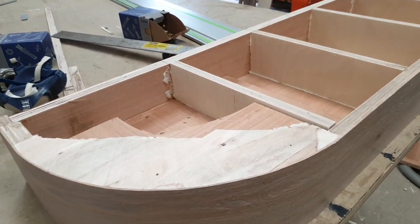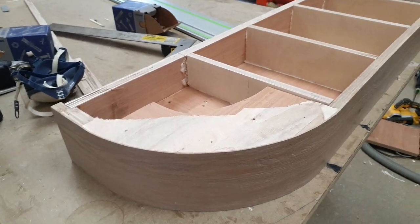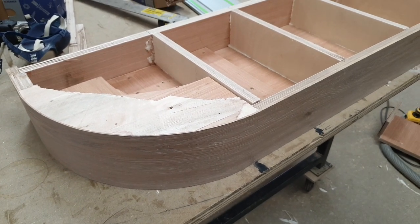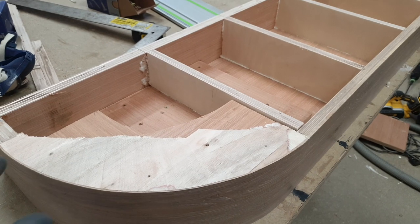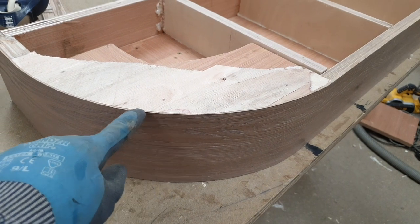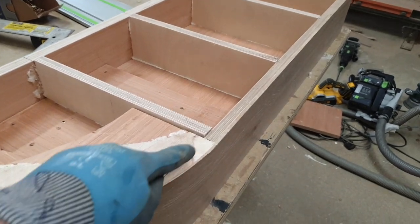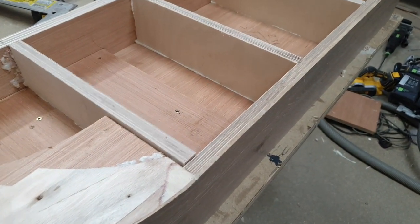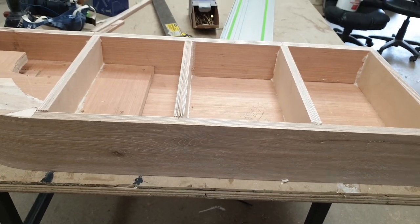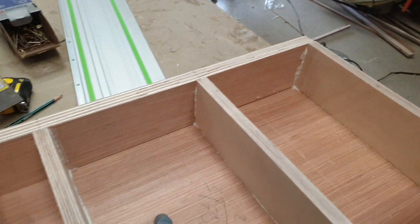So to sum up really, I want to take this to where it's going to be installed. I'll scribe the base down to the floor till it sits nice and flat and doesn't rock or anything, and get it pretty much level across the top. And I'll set up a laser and plane the top in to exactly halfway, so it's got a halfway step, and plane all these down to suit the height that we need, using the laser line as a reference, and then screw this in place through these back pieces and through the side and glue it down,